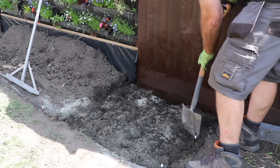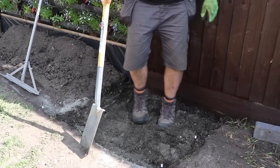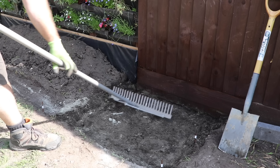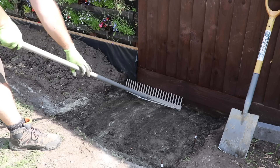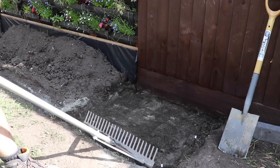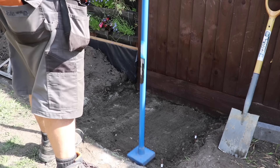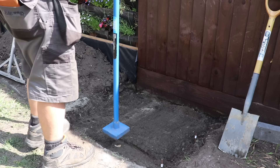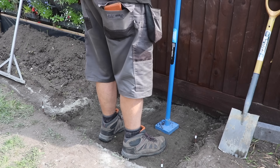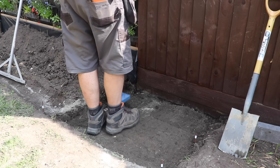Because of the good weather recently the soil is a little bit dry, so I'll just add a small amount of water to ensure the cement can carry out its chemical reaction. When it comes to the amount of water needed, you don't need very much. The more water you put in the less strength you're going to get out of the cement, and it's going to take so much longer to cure and dry out as well. My recommendation is to use as little water as possible — just enough to make the cement go from light grey to dark grey, and that means it's going to do its job.